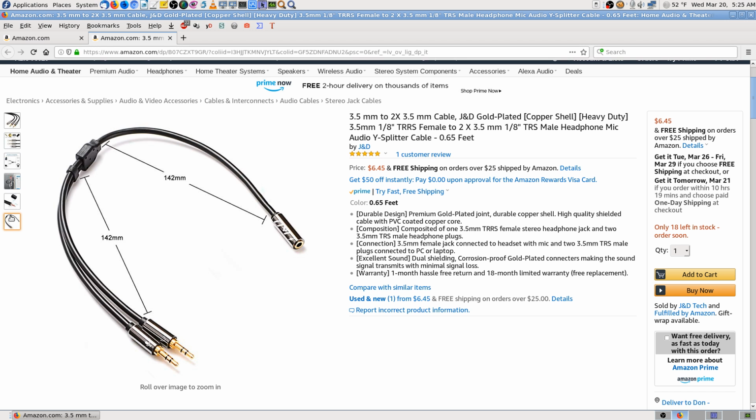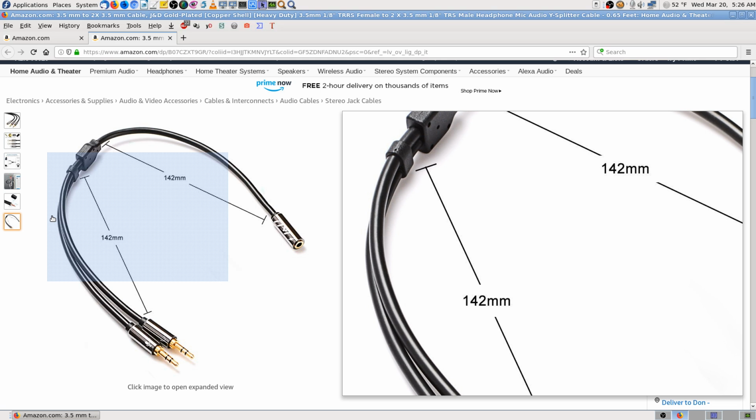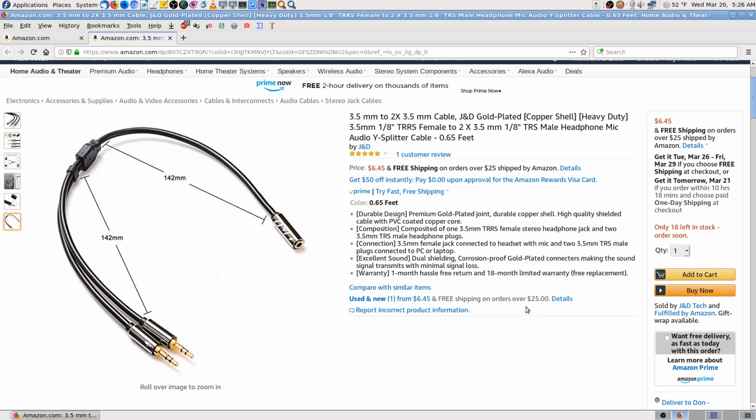That would actually be going the other way. That wouldn't be of any use in that situation if you're plugging a mic into the other end. Now, with adapters, as long as you know which way the signal's traveling and what the pin out is, you can use them backwards or forwards. So that's why you've got to really think about it.